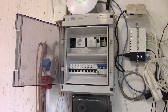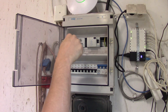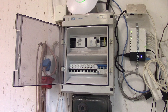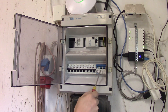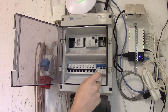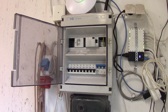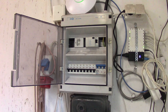Inside here you have the main breaker for this building itself, which will also break the power from the inverter to the grid. We have an earth breaker if something goes wrong. Here are my main switches for the garage itself, and this breaker — 16 amp, three-phase — is for the inverter. There is actually a breaker on the inverter as well, but I want one here because it's simpler. They do recommend 20 amp, but I'm only going to run 16 amp because that's what I have fused in my main incoming and that's what I'm allowed to put back into the grid. It's always good practice to have proper fuses.